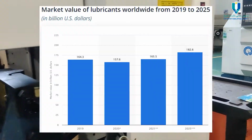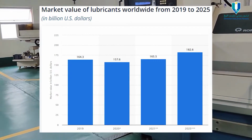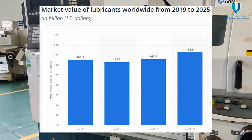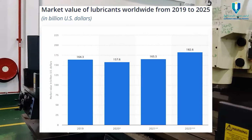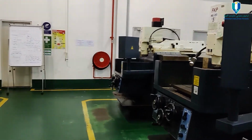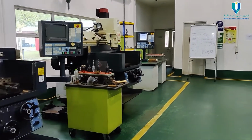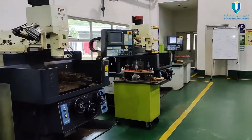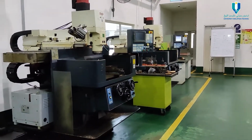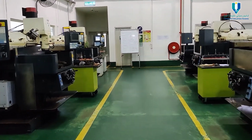Furthermore, according to Statista, as the year increases, the demand for metalworking fluids is increasing tremendously. This is because the mineral resources are decreasing, which is making high demands for mineral-based lubricants, and demands from developing economies. To counter the ongoing situation, a new alternative has been researched to replace the mineral-based metalworking fluids, which is vegetable oils. Tamanu oil is chosen as a new alternative bio-lubricant for MQL for machining operation.